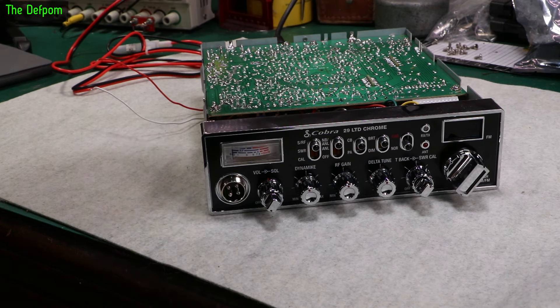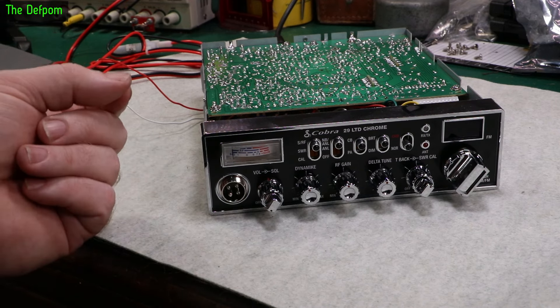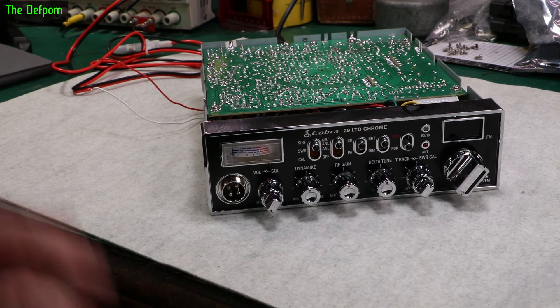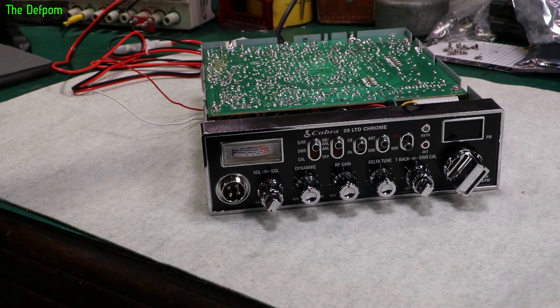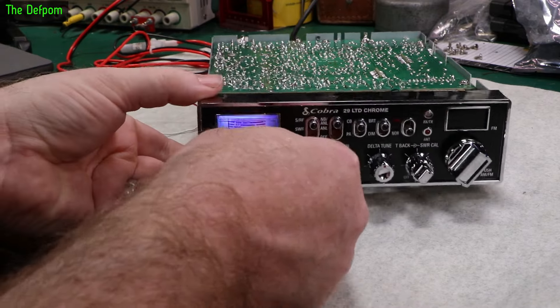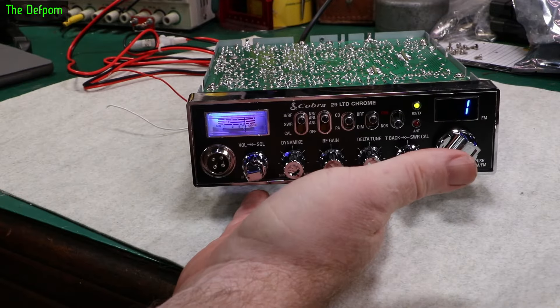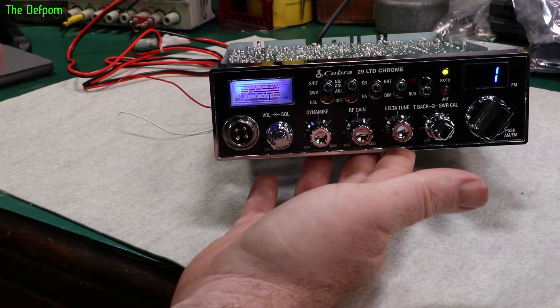The IC on that board is a BK4802P. The P is supposed to be a different package — it's packaged as an N, so I'm not sure about the coding difference. I've found a data sheet for it which tells me in broad terms what serial communication it has, so I can go from there. Powering it up: we're on channel 1 and I have my signal generator putting out an S9 signal at 26.965 MHz, and that's exactly what we're getting. The receiver still works.